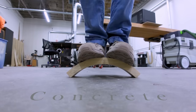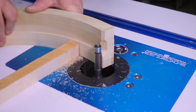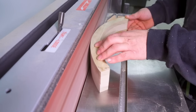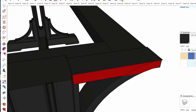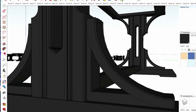There may be some of you thinking that these aren't going to be very strong since they have short grain running through them, so I performed a highly scientific test to come to a concrete conclusion. They're strong enough — I wouldn't lose sleep over it. The L portions of these buttresses are made with two different thicknesses of wood. I came to this result when designing because I need the top supports to be thick enough to connect the subframe to, so I made the bottoms the same, and the sides that attach to the columns looked way too hefty at the same thickness, so I made these five-eighths instead of one inch wide.